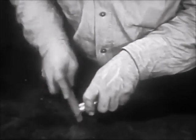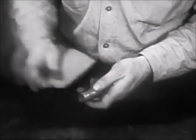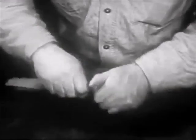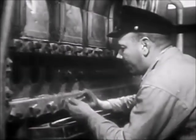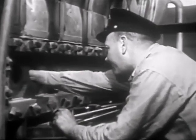Next, clean the interiors of the tube ends. Then remove all scale, burrs, oil, or other foreign matter from the steel plugs used to seal the tube. Insert the small end of the plug into the tube end. With a three or four pound copper maul, tap the plug snugly into place, taking care that the plug is driven evenly with the drum. Plug the other end of the tube the same way. If the end is in a header, work through a hand hole.